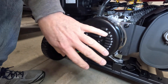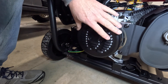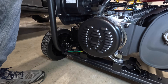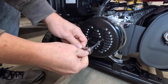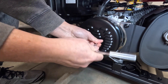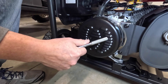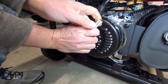We're on the side of the generator here and there are two bolts on the end to pull this end cap off. On this particular Harbor Freight Predator — this is a 13,000-watt tri-fuel — it actually takes a 7mm, so we're going to take these two bolts off on the ends. Surprisingly, I did not see this anywhere in the instructions. I found instructions on how to do this for a few other generators, but I did not find anything for this Harbor Freight Predator.